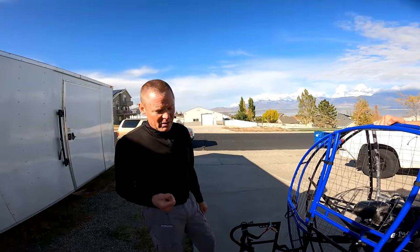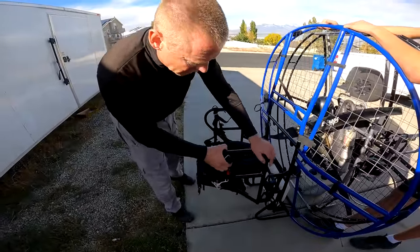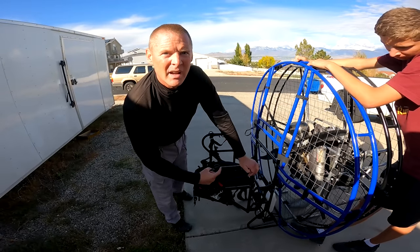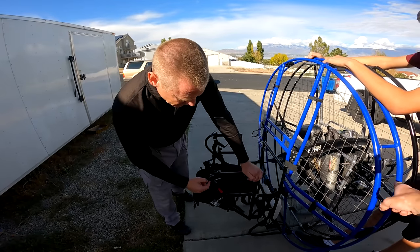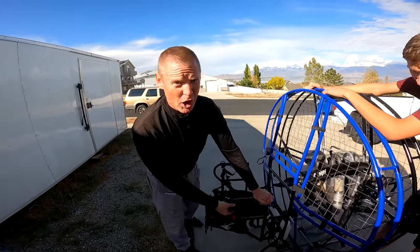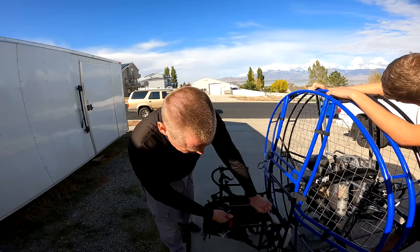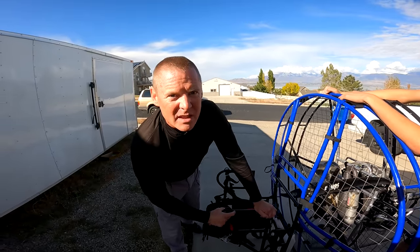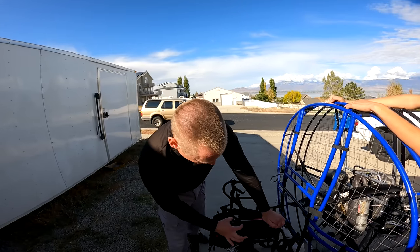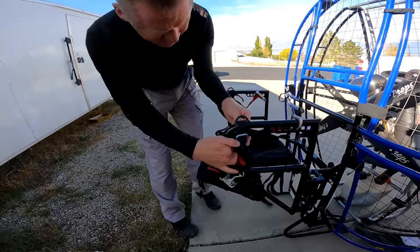Things like putting a metal buckle right next to aluminum — metal to aluminum. They're missing the history of why that buckle was eliminated. For one, it's about a third of a pound, but the severe issue is that when you're running you've got steel rubbing on aluminum, and this will literally rub a hole right through the aluminum. He just reverted 18 years of technology and experience — this metal buckle will literally chop a hole in this aluminum tube. I could probably find comfort bars from 20 years ago that have holes in them right where that happened.